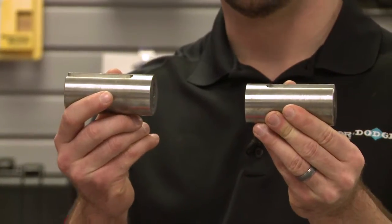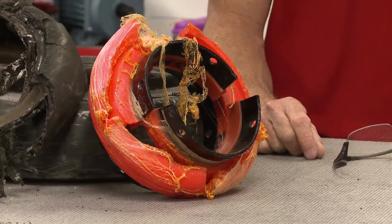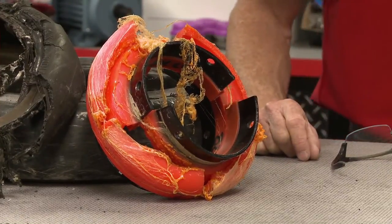Angular misalignment, which happens often, is measured as an angle between two shafts. It's the result of bent shafts or improperly mounted bushings or motors. This tire coupling failed due to excessive angular misalignment, with evidence of failure visible where the element bonds to the clamp rings. The most critical step during installation or maintenance is to ensure that your shafts are properly aligned within the manufacturer's recommended limits, checking for angular, parallel, and axial misalignment. Misalignment failures are often caused by a combination of all three types.